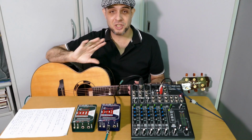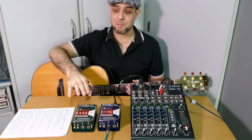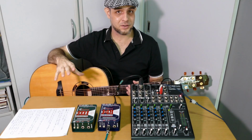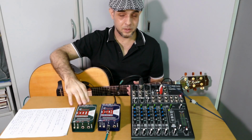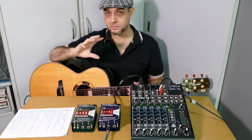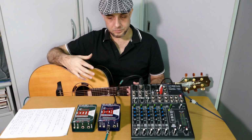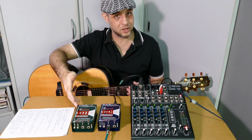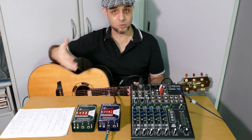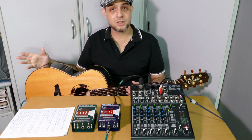The other thing that I did not at all mention in the original video was that there is a significant difference in the sound between passive and active DIs. A lot of sound engineers that I talk to refer to that as being analogous to the difference between dynamic and condenser microphones. With a passive DI, you're going to get a slightly warmer, slightly rounder sound, and this is due to the effect of the transformer on the signal as it passes through. And a lot of people like this, right? With this particular DI box, it has a Jensen transformer in it, which is renowned for its very, very warm tonality. On the other hand, with an active DI box, you're going to get a slightly clearer, slightly brighter sound due to the active electronics. And neither of these are good nor bad, they're just different. So you need to be aware of this difference.